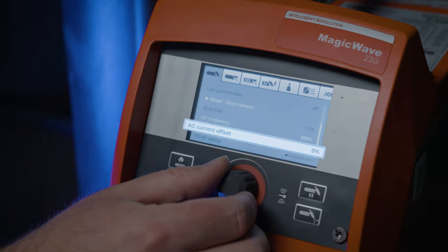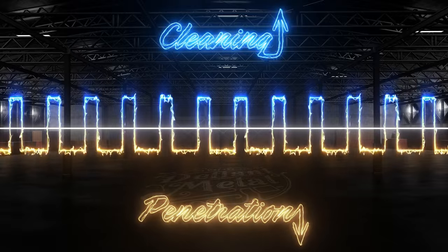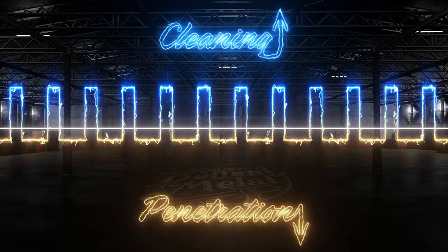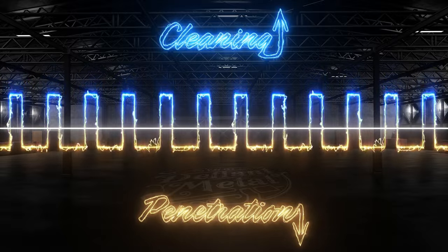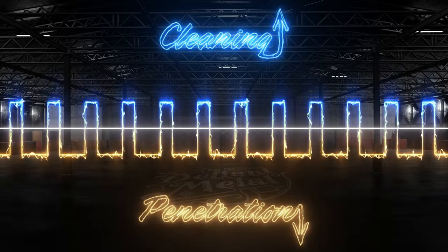The final bit of adjustment we'll briefly mention is the wave's amplitude control — on this Fronius machine it's called AC Offset, but it does the same thing. It changes the amount of amperage assigned to each side of the waveform. Up until now, each side has been treated equally in terms of amps; we were only adjusting how long the arc stayed on each side. With AC offset, in a 70% penetration and 30% cleaning example, you could keep the shorter 30% cleaning time but give it more power than the penetration side, or have a very short low-power cleaning side and a long high-amperage penetration side. This could be really useful in a production environment where you're tuning the machine for a part you're welding over and over.